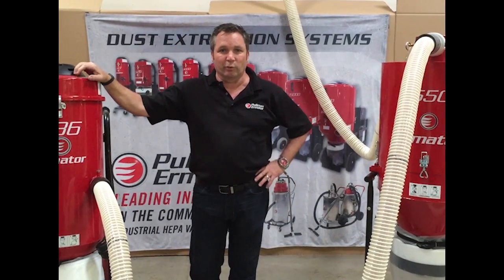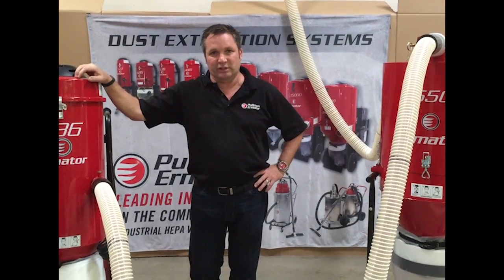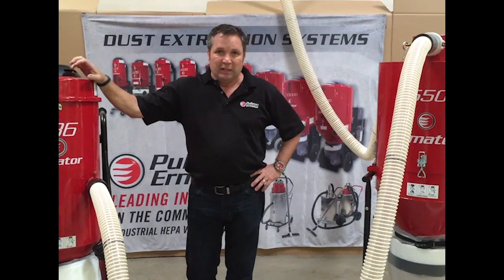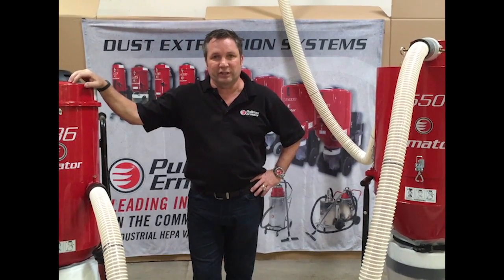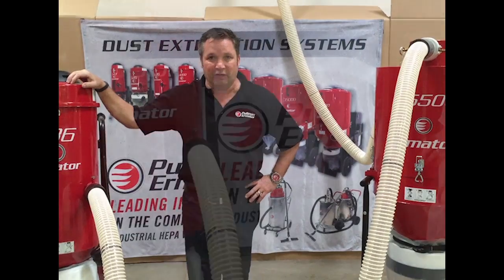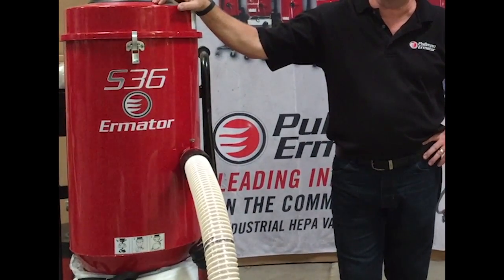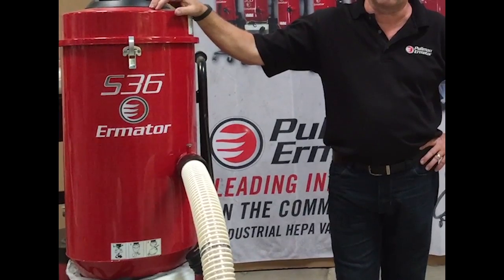Hi, today we're here with the Pullman Ermator S36 and we're using the C5500 pre-separator. The S36 is a 230 single phase high recovery HEPA vacuum with 358 CFM and 110 inches of water lift.